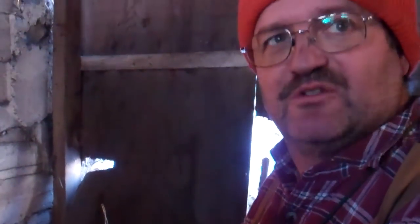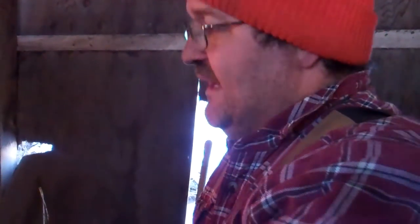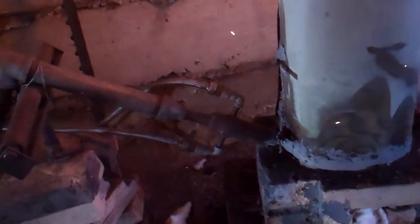You're looking at a smelter. It's based on a European style smelter, so it's tall and skinny and vertical, as opposed to a Japanese smelter, which is like a big trough. Essentially what you do is you alternate charcoal and iron ore as it feeds into it. The pipe there is for the air blast control, but it's got a water-cooled tip so it doesn't melt down. And then the bloom will form immediately underneath that.